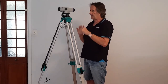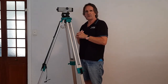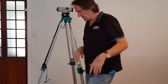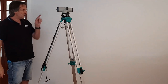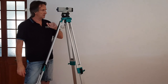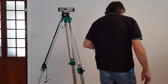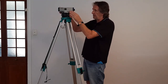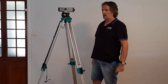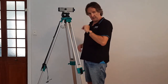When you've done that quick setup and attached the instrument with the bubble in place, it's always a good idea to turn the instrument 180 degrees — this is before you take any readings. Walk around the other side and check that the bubble still remains inside the ring, and it does. Then turn it back and complete the 360-degree turn — the bubble should still be in the ring. The instrument on its horizontal base hasn't moved. We're ready to take some readings and book them on our booking sheet to work out the height from our benchmark to our profiles.